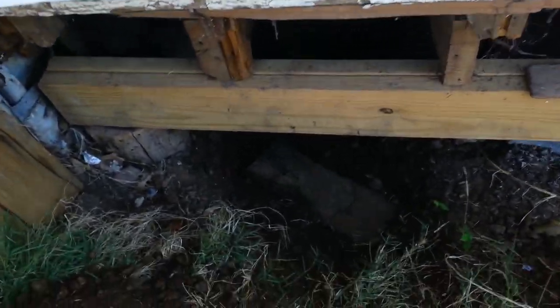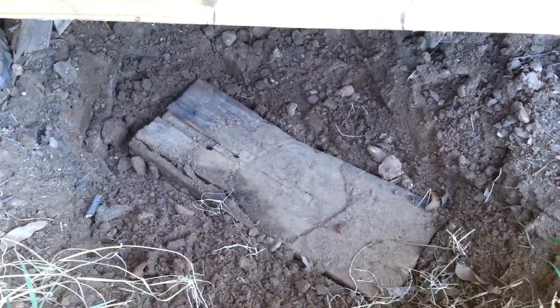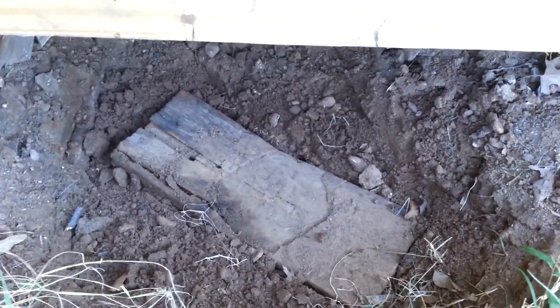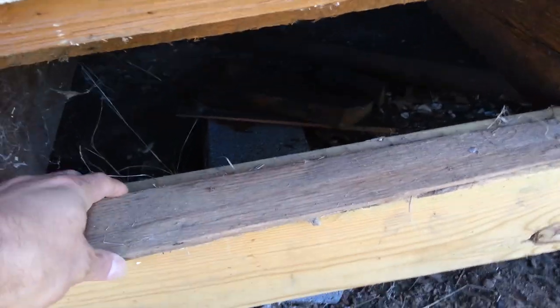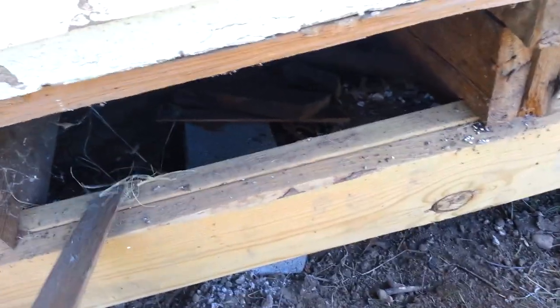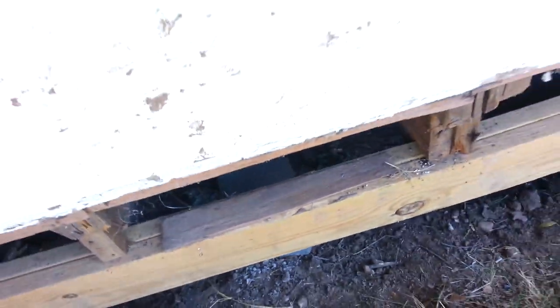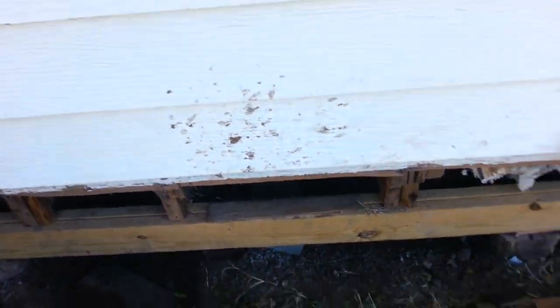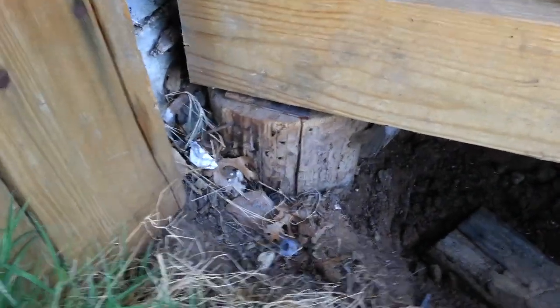It's always good to use something that termites won't want. You can see I've got this board on the ground right here — I need to get that out of there because it will attract termites. All the little blocks of wood that you leave under the house will attract termites, so just don't do that. This is something else you can use as a shim — this is a shingle and it can go into a tight spot, but don't leave them laying around. Stick them up on top of the beams if nothing else, because they will draw termites otherwise.